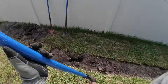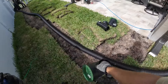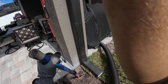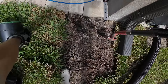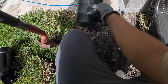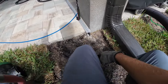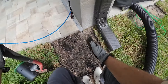Moving down the line, got that next one in. Now, I know all of you at the start of this video were wondering what we're going to do for the channel drain. Catch basin — we're going to do a one-way right here. This super gutter, a six-inch downspout, goes to the lanai and doesn't get a ton of roofline water, so we're just putting a catch basin right here for that. I'm going to do a one-way catch basin right here so this channel drain has somewhere to actually drain. If we don't do that, this sod is going to grow up and block this channel drain and the water is not going to flow out. So we like to put a catch basin right below it and wind that in as well.